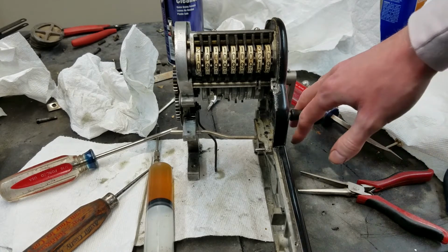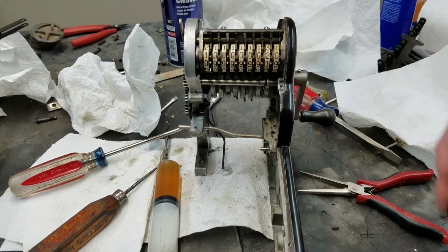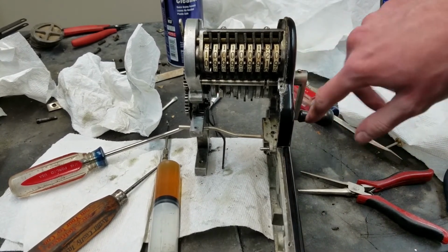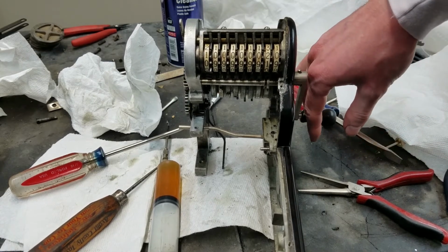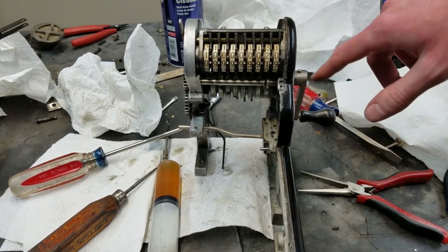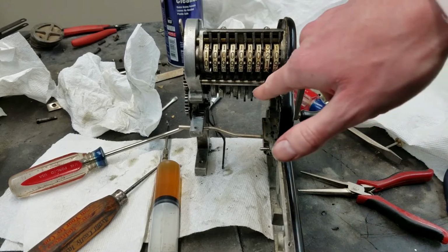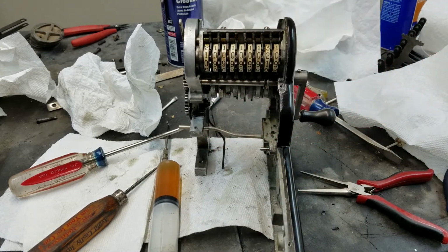It's pretty simple. You got the crank here, which this machine is kind of stiff. I think this might be a little bit bent, and it might be kind of sticking the peg in that hole a little bit. I think this should be a little bit freer, but we'll come to that later. Anyway, the drivetrain is the crank is pinned to a shaft that runs all the way through the center of that drum, but is not attached to that drum.